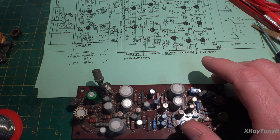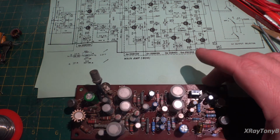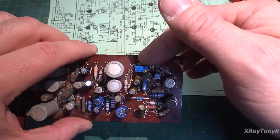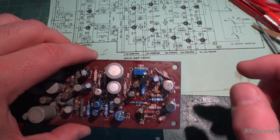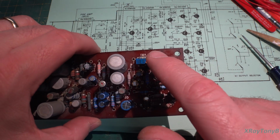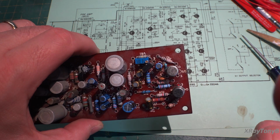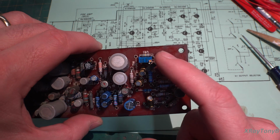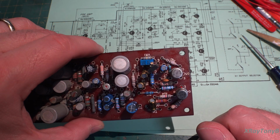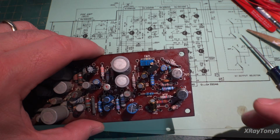So this is a 30K potentiometer, and those I don't have, but I had a 50K, and what I did was I shunted a 100K resistor across it. Because two legs are tied together, as you can see on here, we can get away with that. So essentially that turns this into a 33K potentiometer. And the nice thing is, and I'll tell you why here in a minute, if I need to increase that resistance, I can snip this out and it'll turn it back into a 50K potentiometer, and it's a 15 turn, so I have a lot of adjustment for the DC balance.